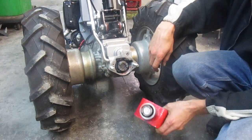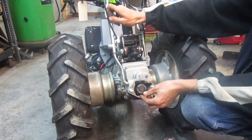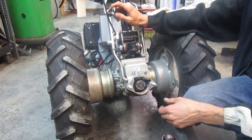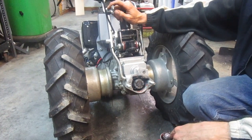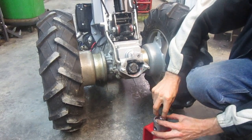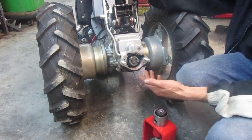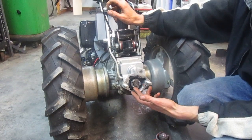As you might imagine, sometimes when the implement is put in place on the tractor and you go to engage the PTO, these three teeth are not lined up with these three teeth. They may meet end-to-end, and if they can't drop down in there, it's not going to want to fully engage. So what you've got to do to make it engage easily is you've got to get this shaft to turn slightly.